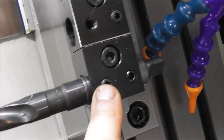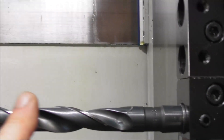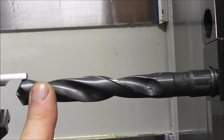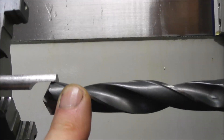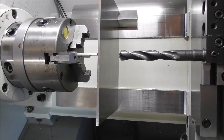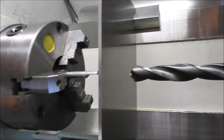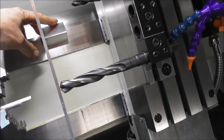If you work off the bore — don't forget when you tighten up your screws, as I've explained in other videos, it pushes it off center. It racks the whole drill off on an angle because these aren't precision fits, and you could be quite a few thou out — you could be 5 or 10 thou out. But this way gets it very close: you're just touching on the side of the drill, you know the diameter, and you enter that in. There's your tool offset on the X. It's a good idea to jog it to zero and do a quick double check with whatever setting gauge you're using — the half-round or this type of setting gauge — just to check you haven't done something horribly wrong.